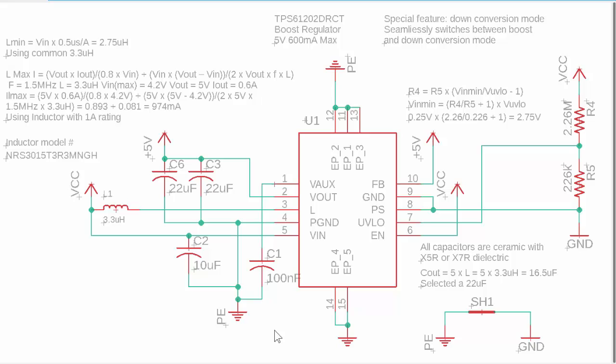Let's look at some of the circuits, starting with the boost converter. From the high-level diagram, the boost converter takes voltage from either USB or battery power — most likely battery — and converts it to a constant five volts. I'm showing this in Eagle CAD software for PCB layout. The red square is the boost converter IC, with capacitors, an inductor, and green lines for electrical connections. Nets with the same name like VCC are electrically connected. This is the same circuit I covered in another video on lithium-ion battery charging.